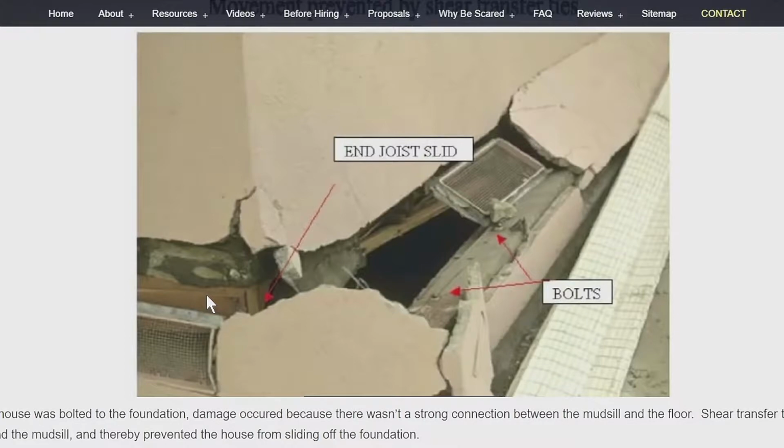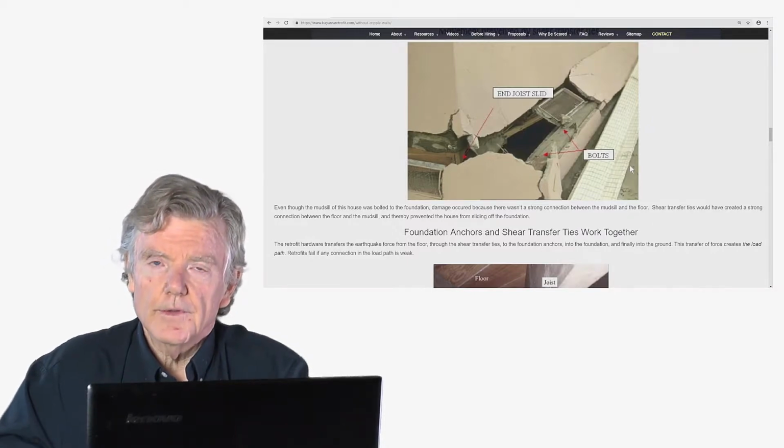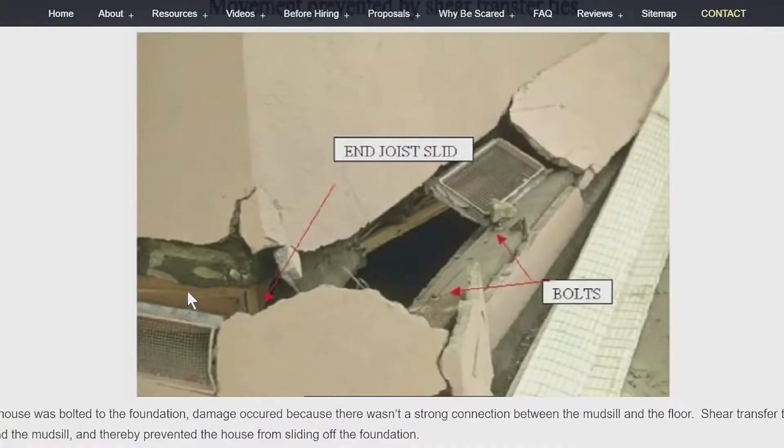which is quite a bit. This had significant damage. So I'd like to point out that this house was actually bolted. It was bolted quite well. These bolts are pretty close together. But even though it was bolted, it had significant damage. So what we would do here is we would attach the joist right here to the mud sill to prevent